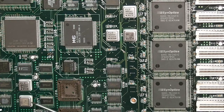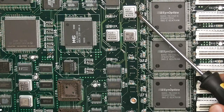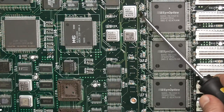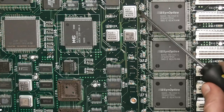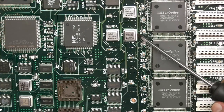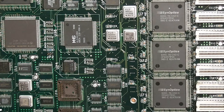Here's another interesting thing. There are five crystal oscillators here. This one has 12.5 MHz, 10 MHz, 30 MHz, 25. And this one has 24.995 MHz. So usually when those frequencies are uneven like that, it has some reason, for example, to generate RS-232 baud rates more easily. But with this frequency, it has not. And the thing that comes into my mind is maybe it isn't very beneficial if you need two 25 MHz clocks to have them precisely running at 25 MHz. Maybe it is advantageous to have those at a slight offset as those two are, so that maybe there's not some kind of weird resonance phenomenon going on or something like that.